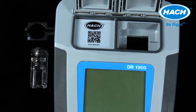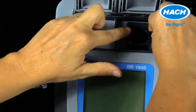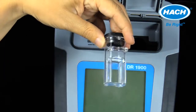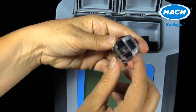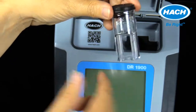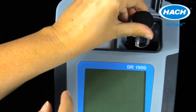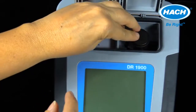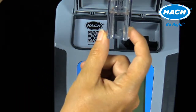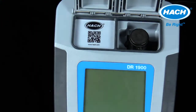This plastic cell is uniquely designed to provide two path lengths: the first is 1-centimeter and the second is 1-inch, based on the orientation of the cell into the sample compartment. The light path of the instrument is from left to right. This plastic cell will be orientated with either the 1-inch or the 1-centimeter path length aligned to this light path. The written procedure will designate the correct sample cell, sample volume, and correct cell orientation when using the plastic sample cell.